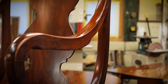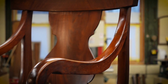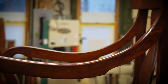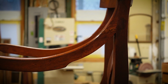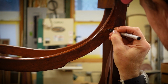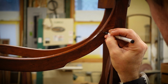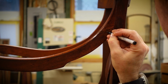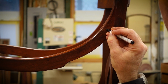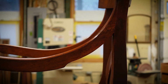The brush strokes work great, but the problem with the brush strokes is in many instances they put a lot of color in there and it's not very smooth. Let's see if we're still on this here. So I'm going to come back over this and put some more of these grain lines back in because it looks as though they've changed slightly. And then primarily I'm putting the grain lines over top of my brush strokes in an attempt to camouflage it further.